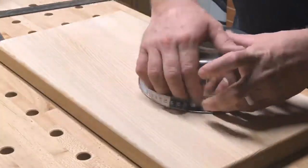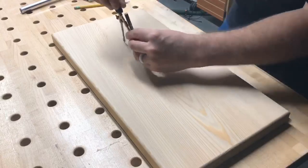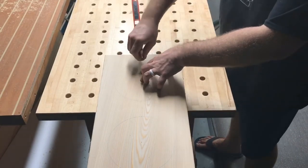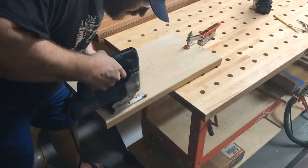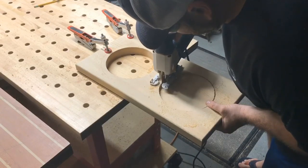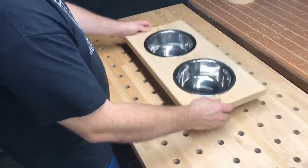I need to find the diameter of the inside of these bowls just under the lip. I take the circumference of each bowl - 22.5 inches - divide by pi (3.14159), which gives me 7.16 inches, then divide that in half for the compass measurement. This gives me the perfect measurement to cut the circles out with a jigsaw. I clamp it down, drill a relief hole for the blade, cut the circles, and then use the quarter-inch round-over bit on both the top and bottom edges of each hole. Perfect fit.